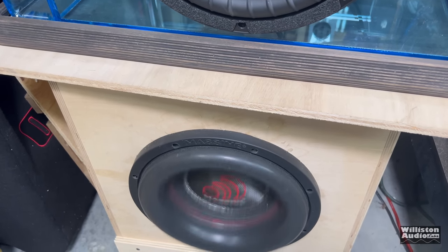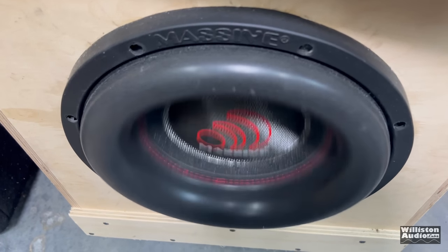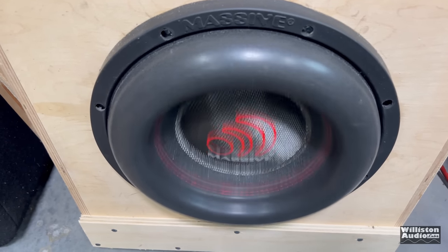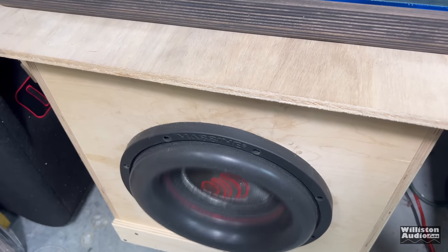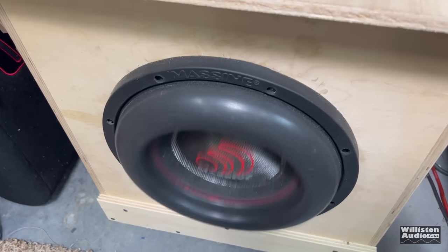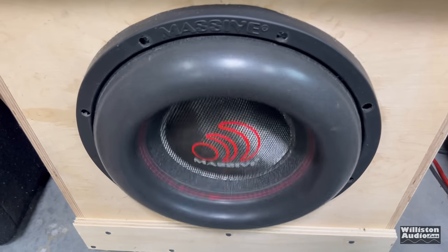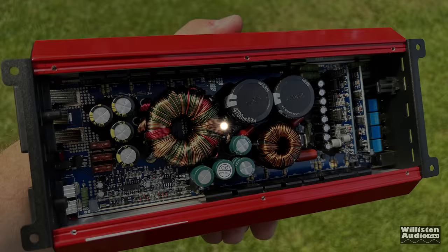You can see this cheap amp is pushing the subwoofer — it's flexing quite well. You are hearing some rattling, unfortunately that is stuff around my lab — my apologies for that. Now let's try the woofer test and see how it works with multiple different low frequencies. The big thing to note here is this sub is wired to half an ohm, and this amp ran for 30 minutes doing these tests and music tests with no problems.